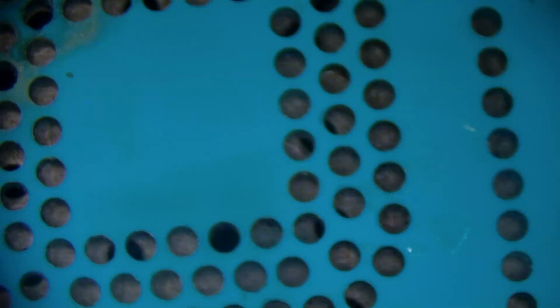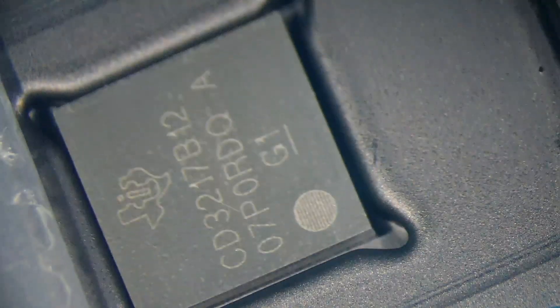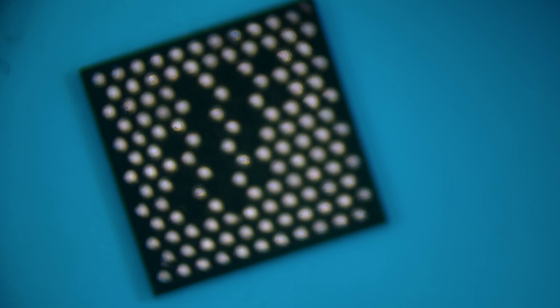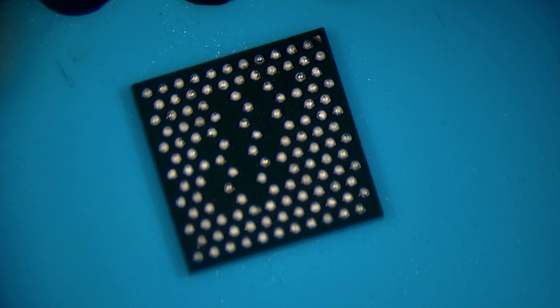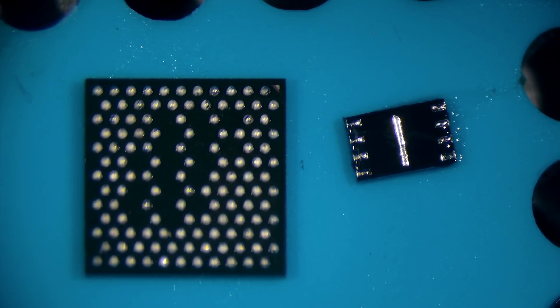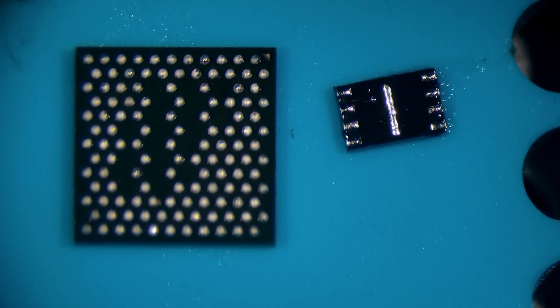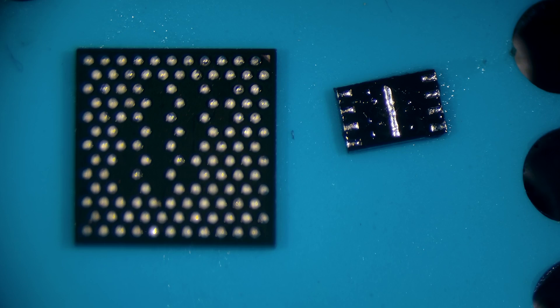All that's required now is to tin the bottom of the ROM IC, because it doesn't come pre-tinned. The CD3217B12 chip doesn't need to be re-balled — it already comes with the balls on it and requires no programming. So with the ROM IC programmed, you now have a brand new set of chips ready to be installed. That's the method for replacing using brand new chips rather than a donor board. I hope it helps someone out — give us a thumbs up if you like the video and subscribe if you want to see more. Thanks.